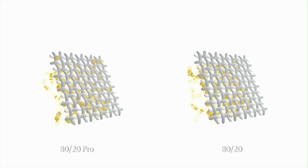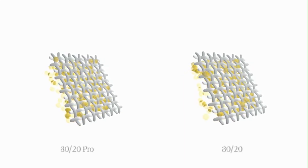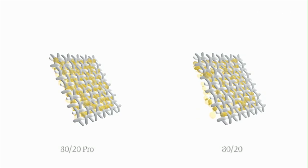The difference compared to previous lamination resins? It's really quite simple. 8020 Pro is not as viscous. This lower viscosity offers clear advantages. The resin can penetrate faster and therefore displaces the air in the reinforcement much more effectively. This is a big plus for the quality of the finished component — it turns out much stronger without air pockets. I experience this benefit daily in practice.